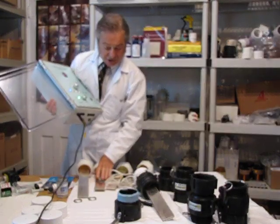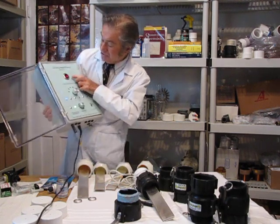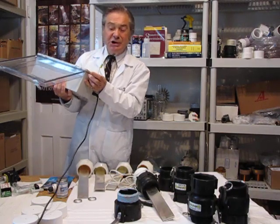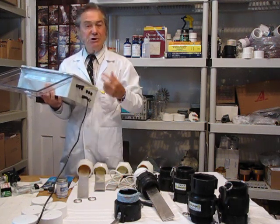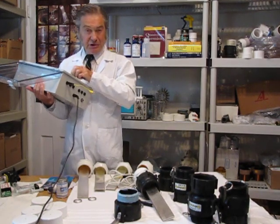Because of this size, you wouldn't want to go more than about 60 milliamps, and that's indicated on the meter here. It can go up to about 120 to test. You can test the integrity using the little light bulb that I provide to make sure that each channel is actually working. If I turn that down, the light goes out; turn it up full to maximum, that little light comes on.